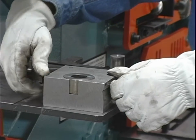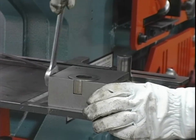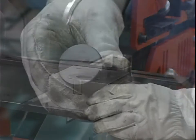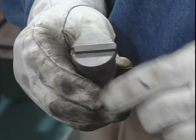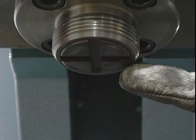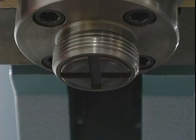Tighten the bolt firmly with a wrench. Please note, all of our shaped punches including squares, ovals, hexagon and special order punches are manufactured with a keyed alignment system. This keyed slot mates with the slots in the punch ram to allow for two different positive lock positions of the punch. We strongly urge you to take advantage of this feature.